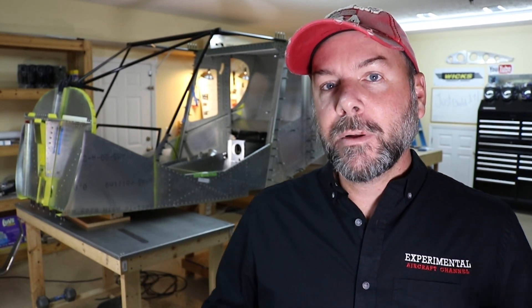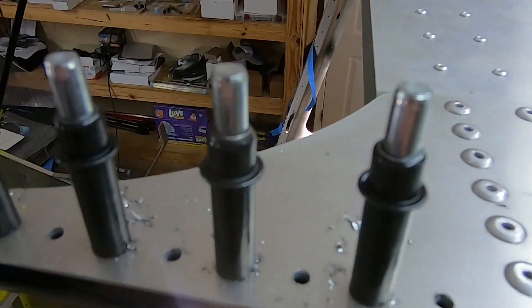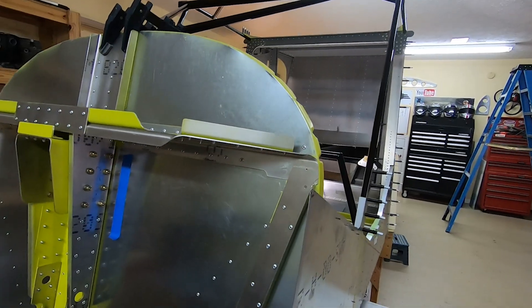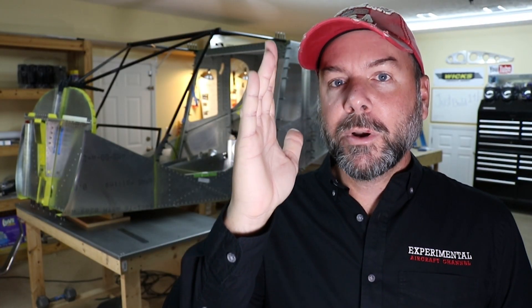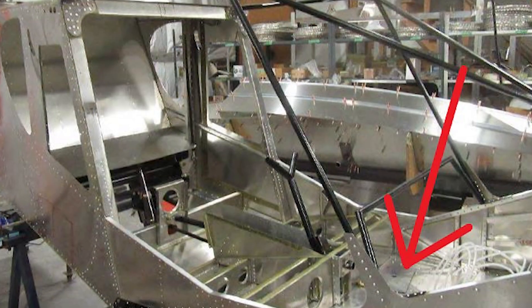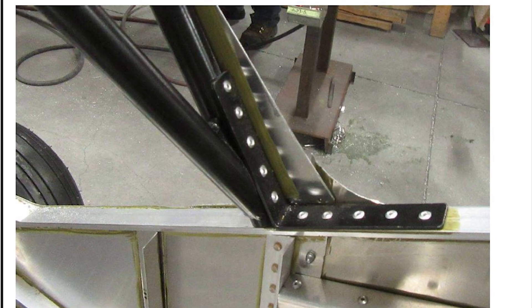I wanted to make sure everything was one-to-one before I put the cabin frame in and started drilling any holes, just to make sure everything is level and straight. I took a level to the firewall going across to make sure there's no twist from side to side - obviously don't have any twist in the aircraft, but I think that's a very critical point because of the forward landing gear. If that had a tilt, the bottom of it would be way off. Everything's squared up, the cabin frame is drilled out to final hole size. There is a cabin frame L-angle gusset on the forward part of the cabin frame that I still need to drill out.